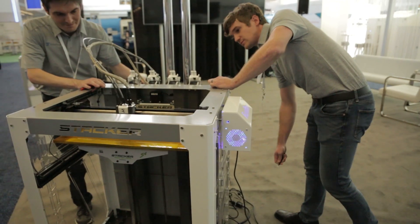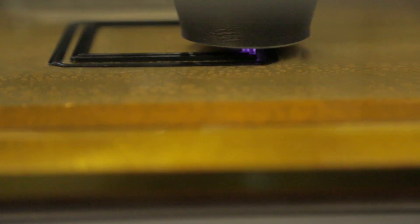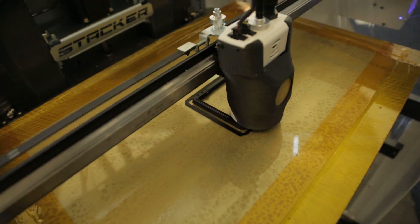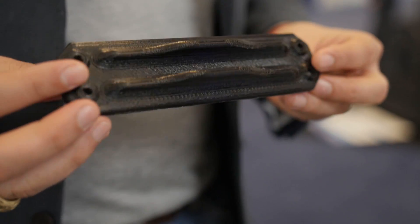What we're doing is we're reheating, heating, and post-heating that plastic, creating a much larger heat affected zone in the plastic part. It makes the part stronger in all directions, but most importantly in between all those layers.